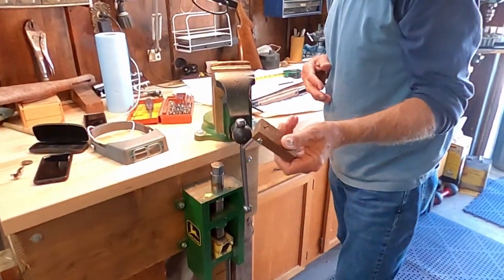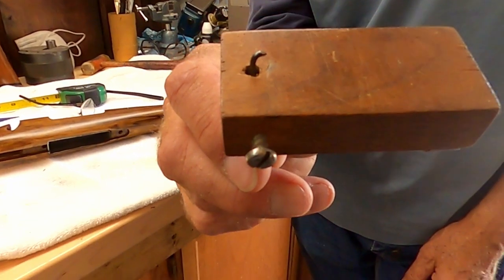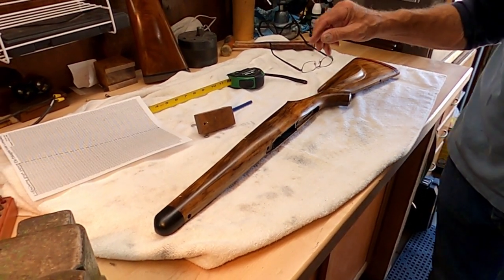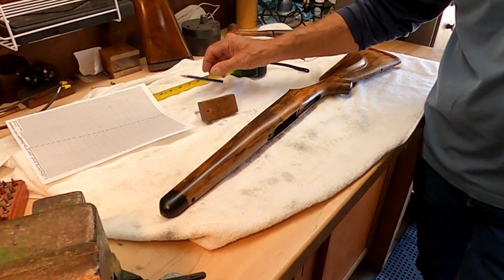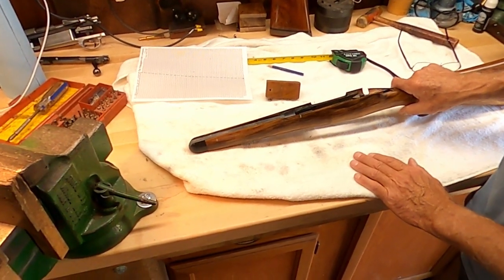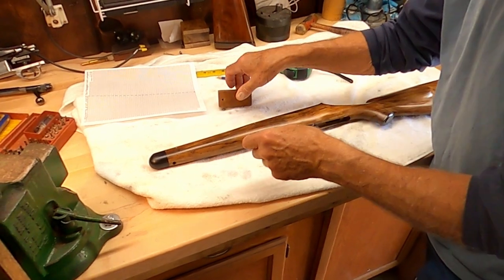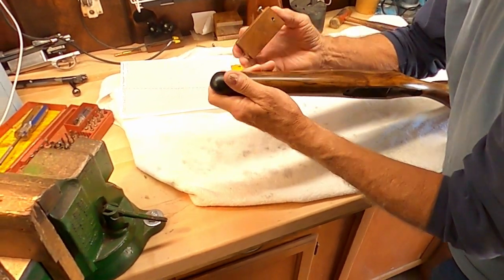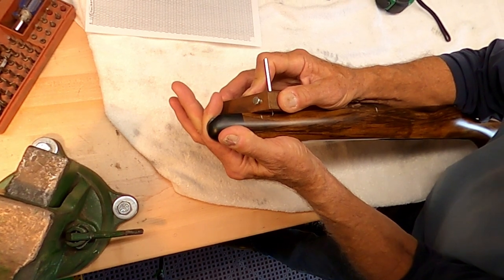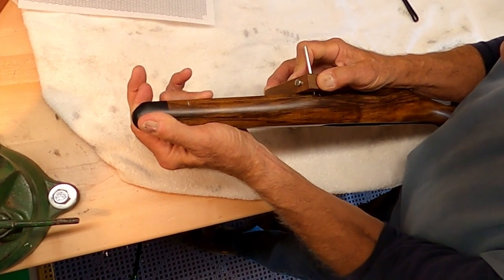This is a depth scribe for the side lines — it's just a dental pick that's been bent over, adjustable, with a little piece of wood. So instead of laying this out with a straight edge and pencil and then following that hopefully straight line, if my top line is straight — which all stock makers try to have a straight top line on their stocks — then this depth gauge works pretty good. I'll go a little bit shorter than the actual white line so I can adjust that later, and if I don't screw this up, it cuts a nice clean line on both sides.